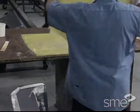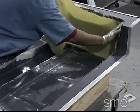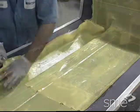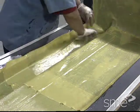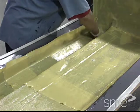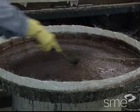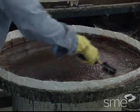The pre-wetted reinforcement material is then carefully placed on the coated mold surface to minimize distortion during transfer. More reinforcement material and resin are applied as needed until the required part thickness has been built up. Typically, the pre-wetted material is hand-rolled to achieve uniform distribution and to remove entrapped air.